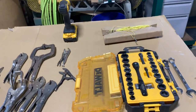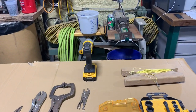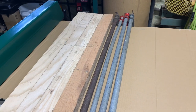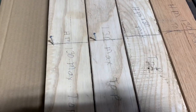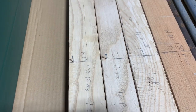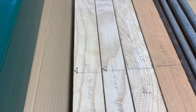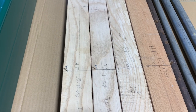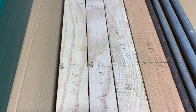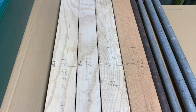I start out with a set of metric and American sockets, a bunch of vise grips, an impact, and a string. I use four bar clamps and I have some spacers here that are pre-cut — you can see they're labeled for HM-130 Max. They're cut to 36 and a half inches long and they have the center line marked down the center. I use them in between the track sections. That gives me the perfect width, and it saves a lot of time.